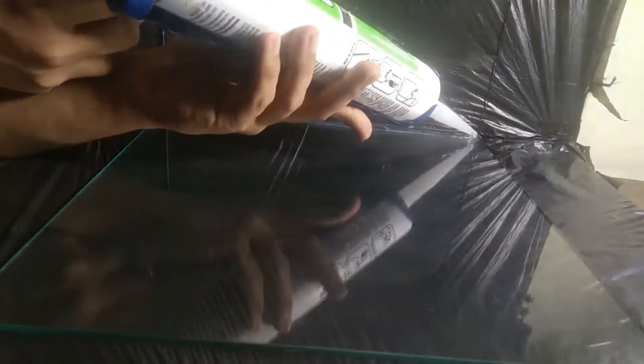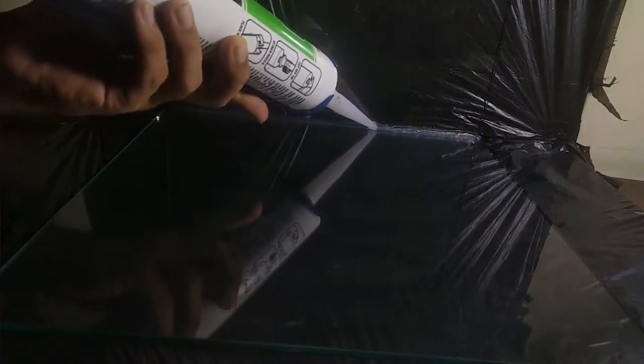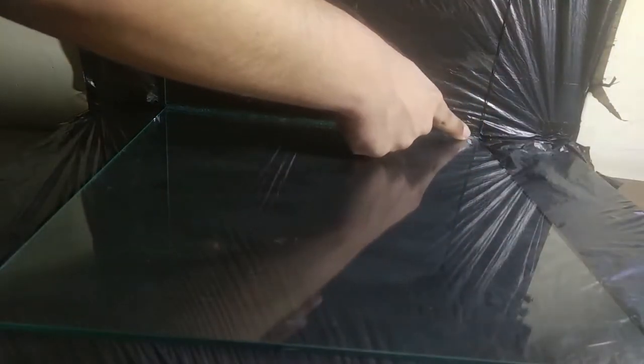After that, I will move the side towards the wall because the wall is completely 90 degree and it will ensure straight joints. And then I will place the base on top of the silicone bead layer to ensure proper connection. I almost messed up here, but yeah, I managed to somehow save it. And after that, I will again apply a bead of silicone along the connecting point and I'll basically clean it off using my finger. So this will ensure nice tight connection.